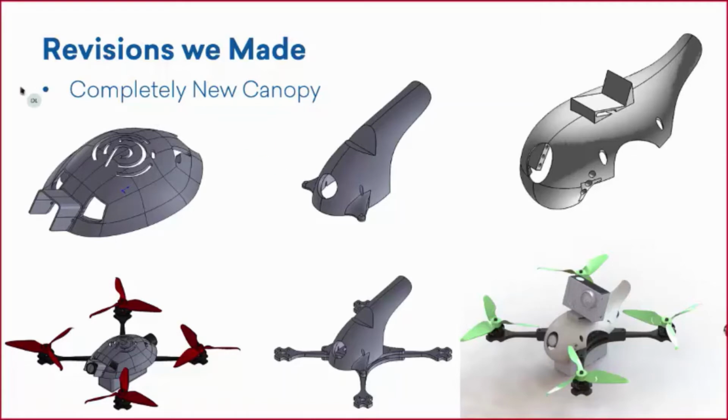So taking a look at this first revision of our canopy, right? It did its job. It worked really well. I think it looked good, and it protected the electronics as we wanted. But once we put this canopy onto the quadcopter, we realized a couple things needed to get changed right off the bat. The first thing was that there's no easy access to the electronics. When you're out flying this, you're out in the field. It's really good and useful to have easy access to the electronics, and the only way that we can get in there and work with those electronics is to completely take off the canopy from the frame and detach it. So not only is that just annoying in itself, based on this first design, it was actually pretty tricky to get that unconnected. So that was our first revision that we wanted to change.